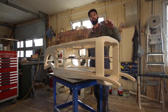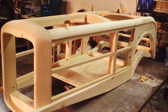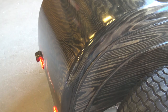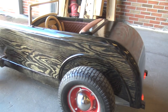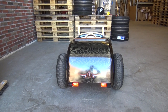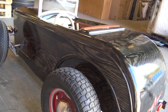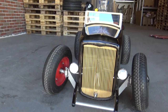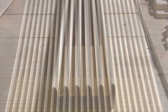For the body, I used dovetails and mortise and tenons on the skeletal structure — a majority of those are unfortunately covered up by the body panels, but I'm proud I did them. The shaping of the rails and radiator were done by hand using an abrasive sanding disc. The panels were recessed in and stained with a black stain, with a polyurethane spray over the top. I had a few troubles with the polyurethane — probably didn't mix it well enough — but overall I think it looks super tough.